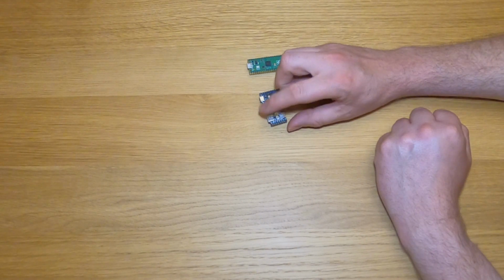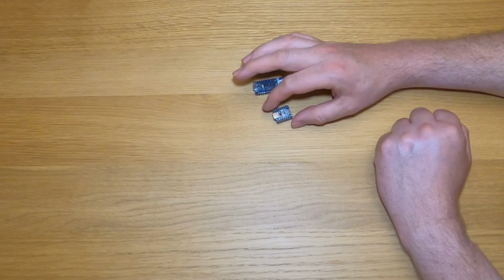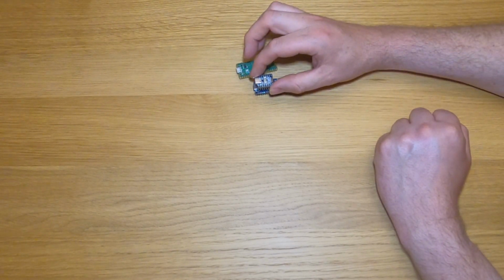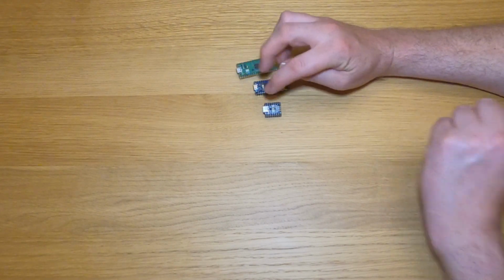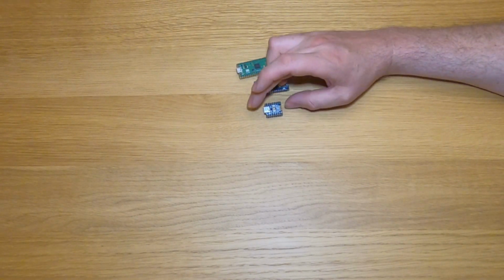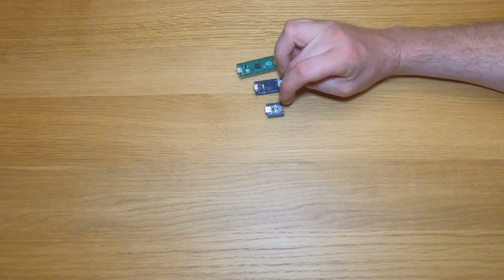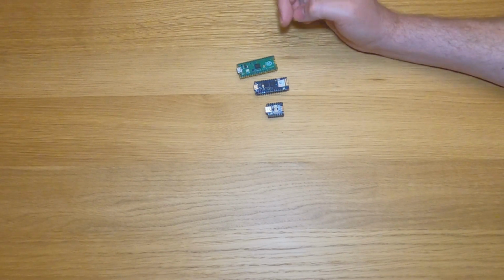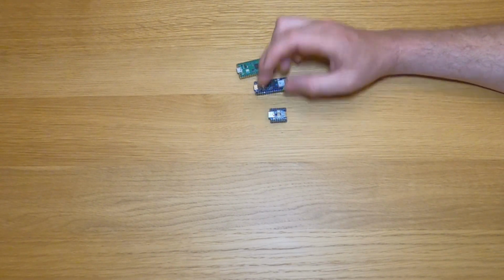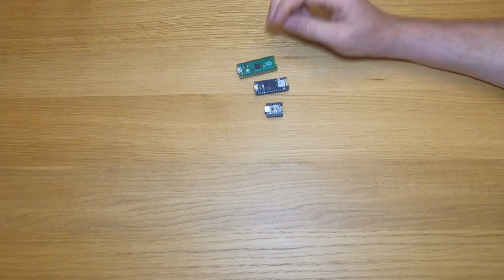Significantly, the Pimoroni one has a USB-C, whereas the others have micro USB, and basically it's the same width factor, but it's a lot shorter. But this is a lot more limited, as it's basically just the bare processor or microcontroller, with only a few pins available. But if that meets your needs, that's quite a nice little tiny solution.